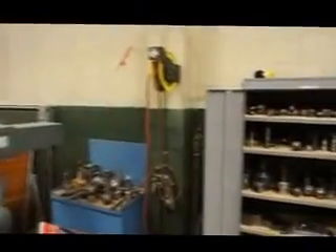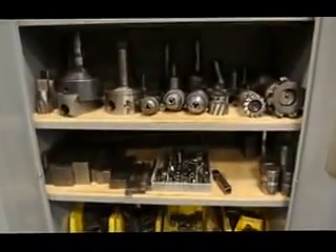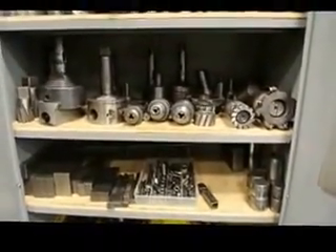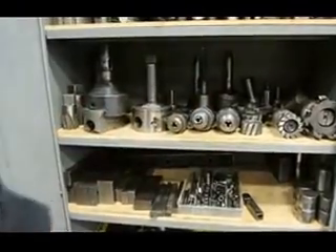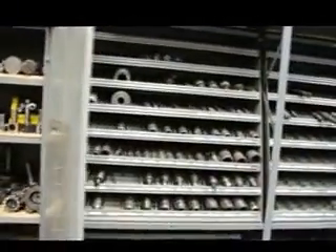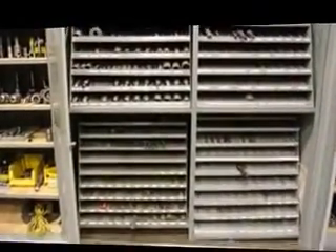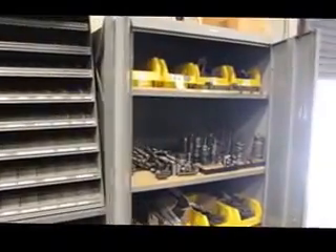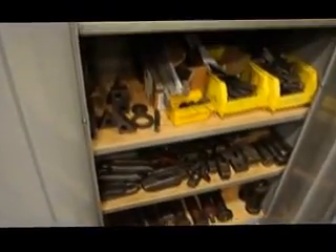I'd like to go ahead and point out some of the accessories that come with this machine. Miscellaneous tooling — there's quite a few items here. There's some drill chucks, all on the number 5 Morse taper. Boring bars and things of that nature. A various assortment of Morse taper drill bits, quite a few, including the cabinet that comes with it — everything from small to large. Great assortment. Also, this is the cabinet that comes with all of the clamps — well tooled for the clamps.